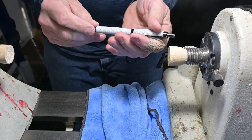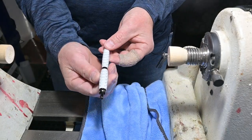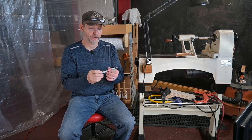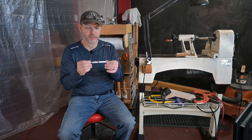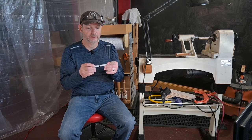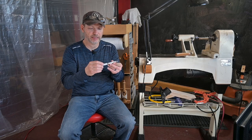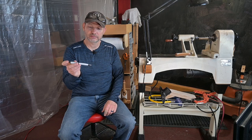Oh, that's pretty. And I did a pretty good job lining those up. The gunmetal chrome Tempest pen kit — it's a click pen kit with a very smooth mechanism. I like this one; it's pretty nice. It's by Buford Inc. The white honeycomb blank — take your time if you're going to turn one of these. There were some instances where the white peeled away from the aluminum, but as I got closer to the center it was more stable. I think it's just on the outer portions — maybe just the way it's cast. It turned out beautifully. I love this pen. I may actually keep this one as one of my everyday pens. We'll see.